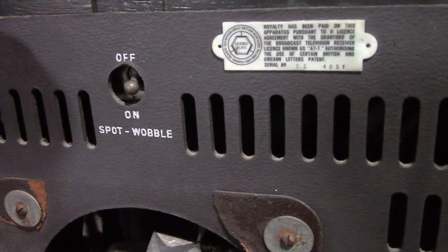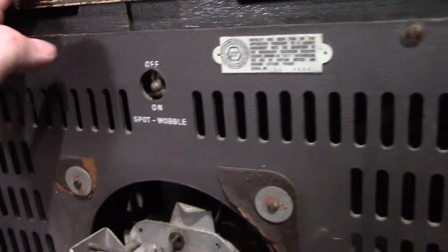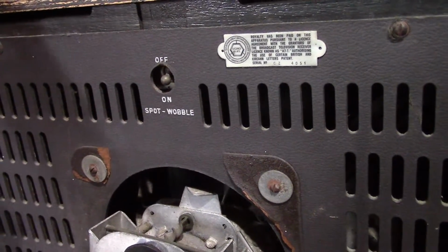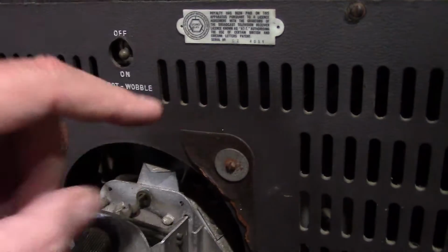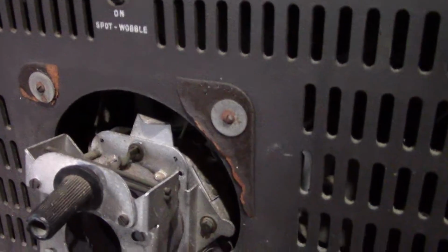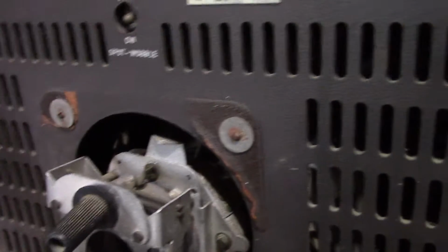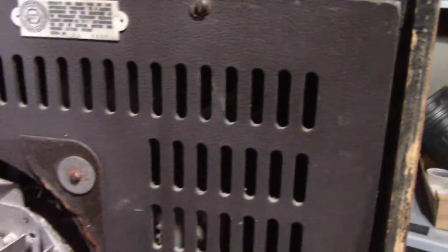Well, it turns out that, if you're watching my videos, you see me show close-ups of the image on a CRT. When the focus is adjusted sharply, you can see the scan lines when you're up close. Quite visible on a well-defined picture tube. This introduces wobble into that electron beam as it's scanning to try to blur the scan lines together to make a softer, more pleasing image and not those obvious harsh scan lines. Especially when you only have 405 lines, you can imagine it's more pronounced than when you have 525 or higher. And yes, some of those are in the blanking interval. You don't see all of them, it's more like 480 lines. I know, I'm just simplifying things, but that's what that's all about.